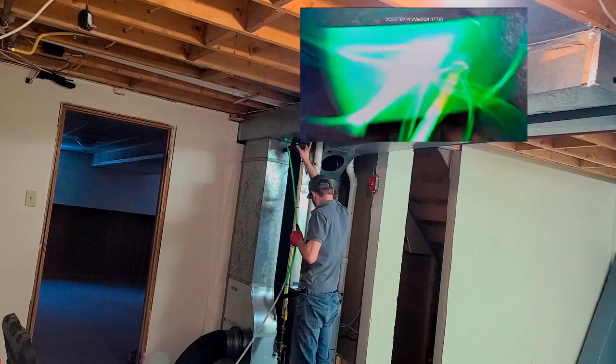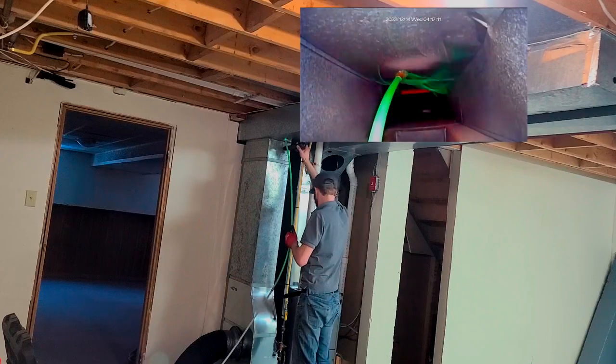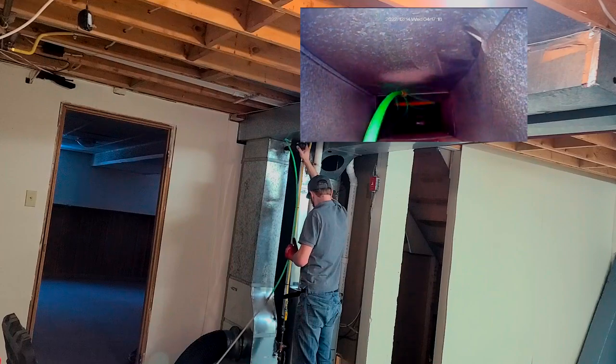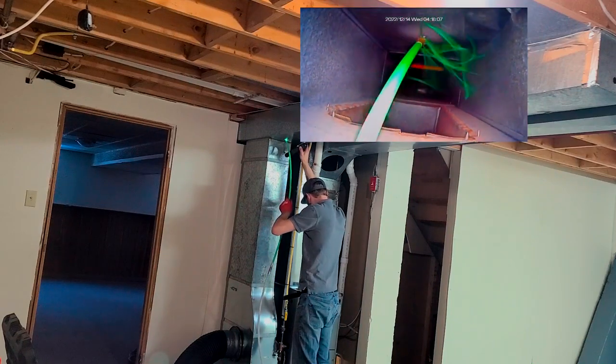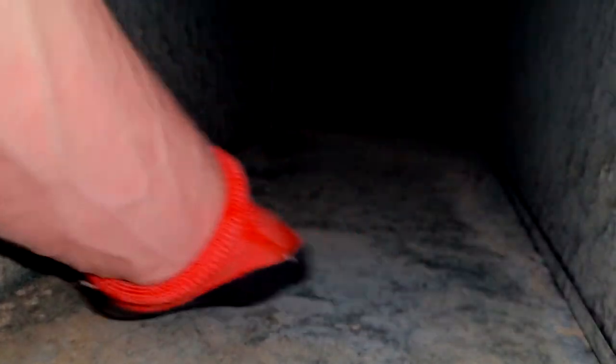Here I'm trying to clean what I think is dust at the moment, but it's really a duct sealer that's been applied some time ago. We also clean out the J-transition connected to the furnace, though I don't show it on camera. Checking to make sure what I thought was dust is just the sealer — this is where I found out it had been painted some time ago. It's nice and clean though.